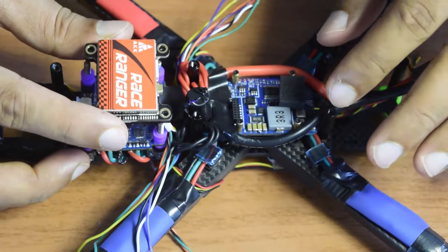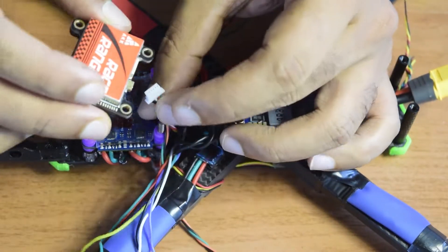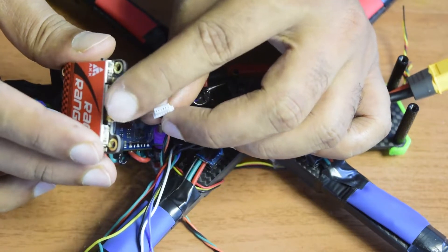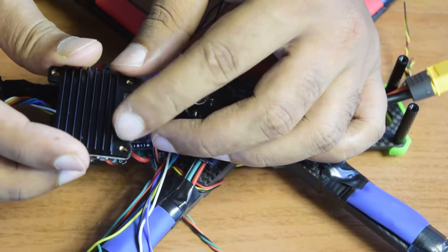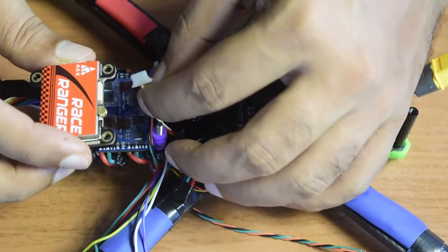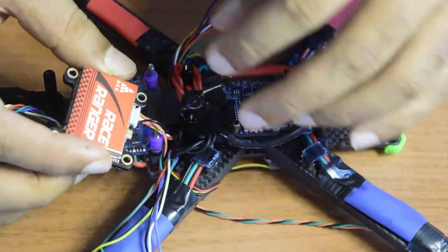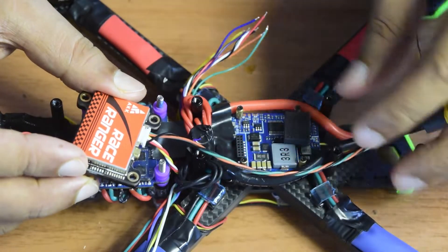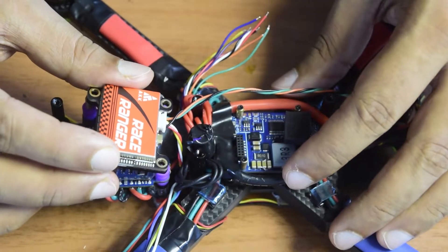Let's get started and install the video transmitter on top of the stack. First, you need to connect the jumper connection I've already prepared. Ensure it is in the right direction, otherwise you will damage the small inside pins, which will be difficult to repair. In case you do damage the pins, there are solder pads on the back which you can use to solder individual wires and connect them to your flight controller or external DVR. So just be careful to install the jumper in the right direction to avoid damaging the jumper port. This is how I have connected it — one set going to the front for the flight controller and one set going to the back for the external DVR.